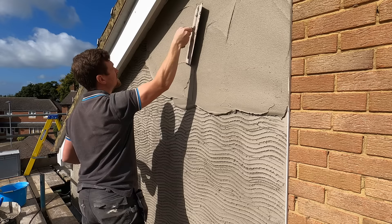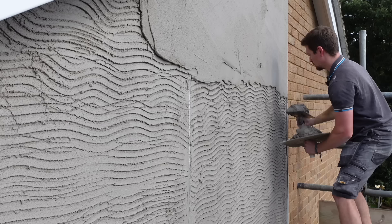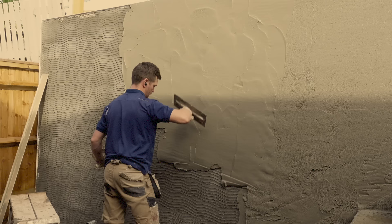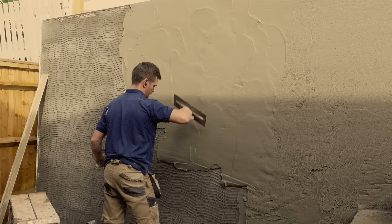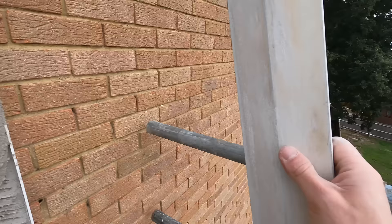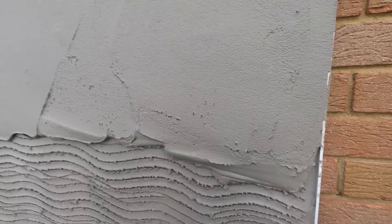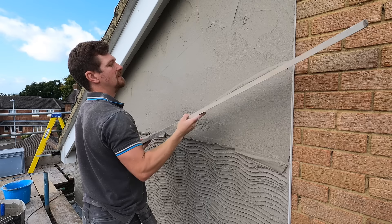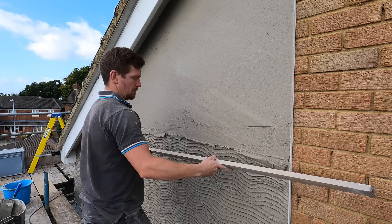Let's think about this for a second. We're literally applying both coats in one day. How much more efficient is your life going to be if you can get a wall completed in one day without worrying about prepping each coat in between? The other thing is it doesn't sag, it doesn't move around like common sand cement does. With this product, we literally just do the first coat, scratch it, apply your second coat, first day, no worries, no issues. And look, it rules like it's a latex render, like a hard wall plaster — it just rules so nicely without any sagging or issues.